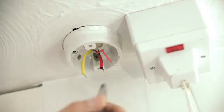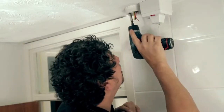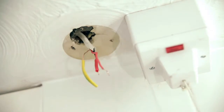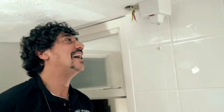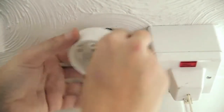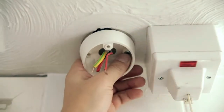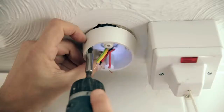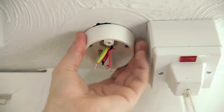Now with my electric screwdriver we can take this base off. One screw, there's the other little one, and another one. Now it's all down, we can put the new one up. Got the base — tap with your pliers to make a little pokey hole so we can get the wires through. And let's fix this base up to the ceiling — we can try and locate the old fixing holes. That would be very handy. Nice and tight, it ain't going nowhere.